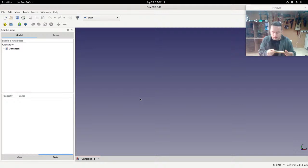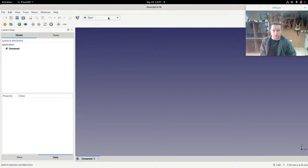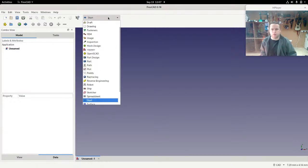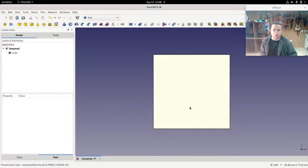And in this case, it is 120 millimeters by 76 millimeters. So let's just create a rectangle. Now this gives you different consoles, which have a lot of different toolbars from which you can select various tools. So the one we're interested in right now is part. Part is what you'll mostly be using when you're doing constructive solid geometry, CSG. It includes all these solids and various things you can do to the solids. So we're going to start off with this cube-ish thing. It says cube, but it ends up being a cuboid.